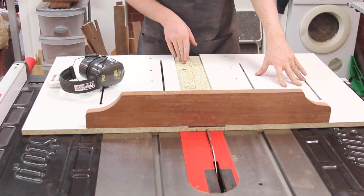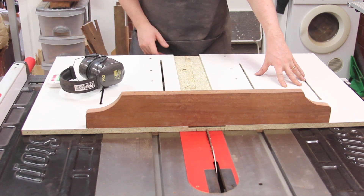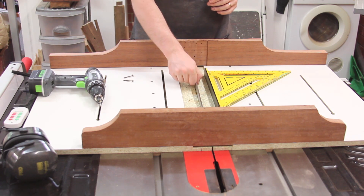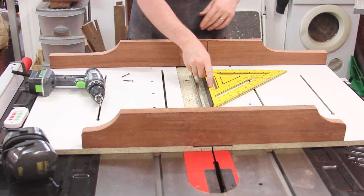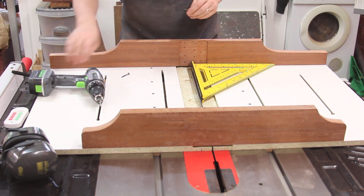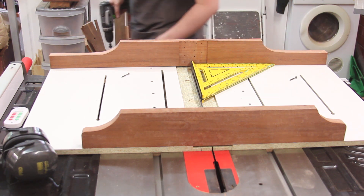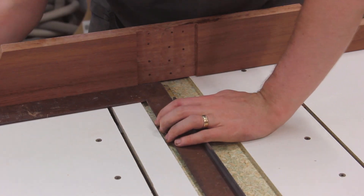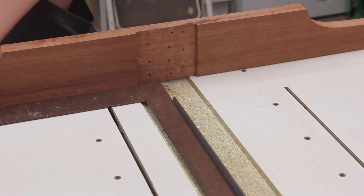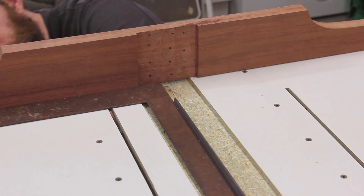The alignment of the front fence does matter — it has to be square with the blade. The easiest way is to first cut the kerf, going about three quarters of the way through but not all the way, then attach the fence accurately. With the kerf cut I've got two rules — one thin, one thicker — that fit into that slot perfectly, so I can run a known square up against the fence. I'll drill and countersink one screw at one end so I can pivot the other end to get alignment correct. After finding my largest framing square, I placed it against the rulers in the kerf, moved the fence until it was square, clamped it down, double-checked, then drilled, countersunk and screwed the fence down. After a final check for square, I drove more countersunk screws into the fence.